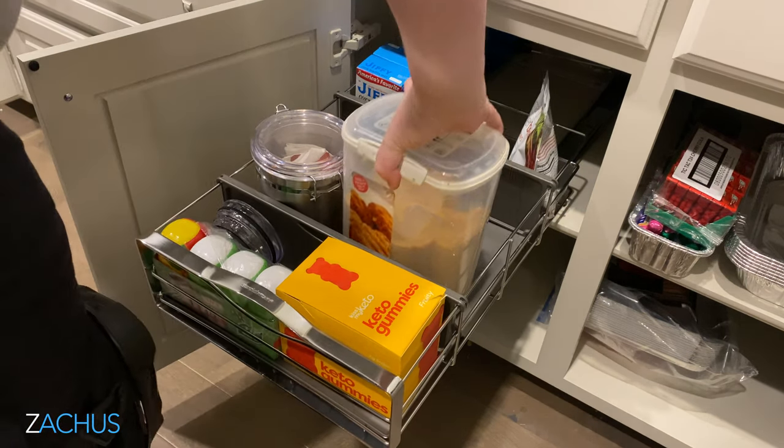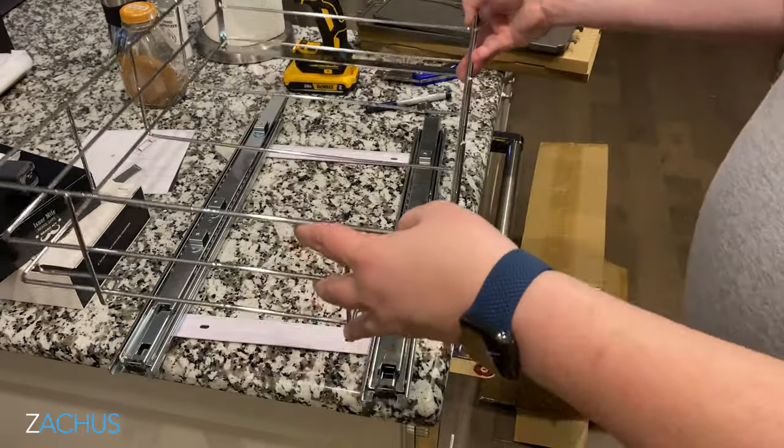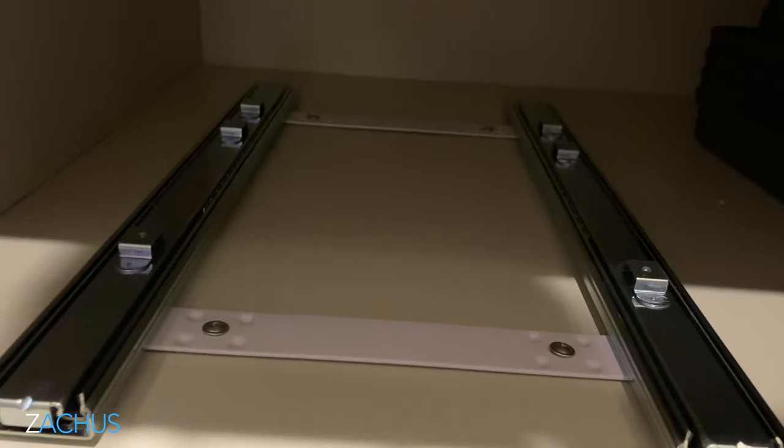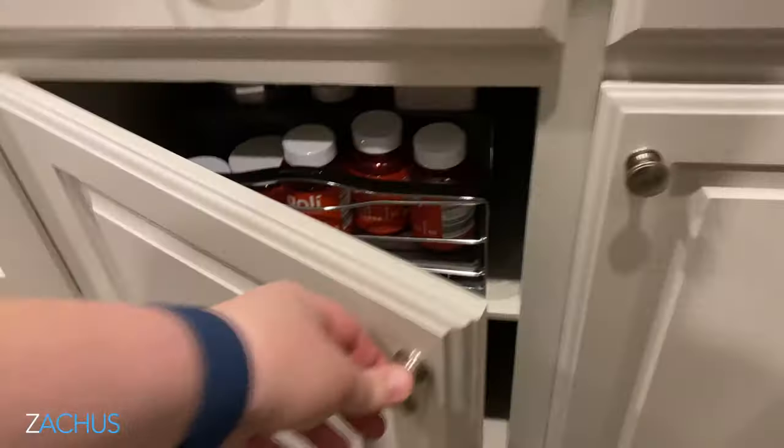I'm going to install more. They're $70 a piece so they're kind of pricey, but I've got a couple more cabinets with junk everywhere. I have a big island with an even deeper cabinet so it'll be great to pull things out. You can put stuff you never use but don't want to throw away behind the drawer. So to recap: pop that tray out, unscrew the four screws, take the rack off, drill the four screws into the cabinet, put the rack back on, put the plastic tray back in and click it, add your dividers if you need them, and load it up — boom, it's done.